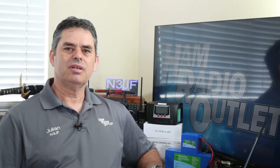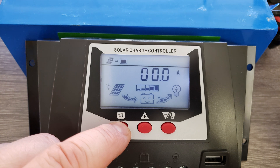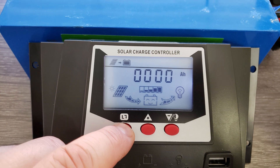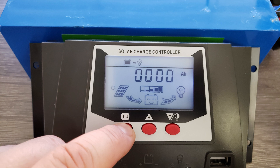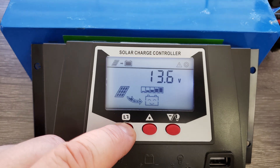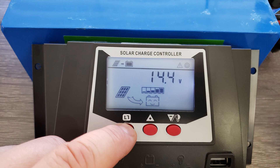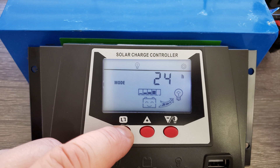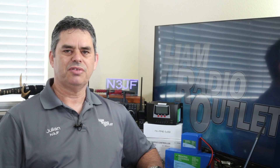In order, these screens are: temperature of the controller; charge current delivered to the battery; charge current going to the load connector; number of ampere hours sent to the battery; number of ampere hours sent to the load; the configuration of the controller; the system voltage — determined by the battery voltage, which is why you must connect the battery first; the recovery voltage, which is the voltage from the panel at which the controller will start to charge the battery; the cutoff voltage, which is the maximum voltage the battery should reach when fully charged; the cutoff current; the low voltage level for turning off power to the load when battery voltage gets too low; and the work mode, which sets the number of hours the load output is active. Some of the values on these screens can be changed while others cannot.